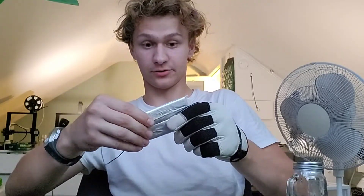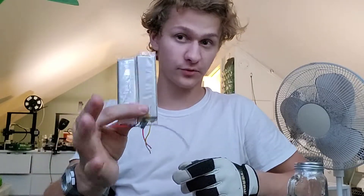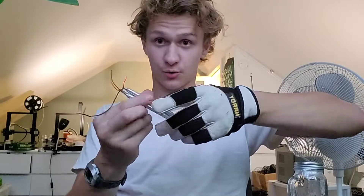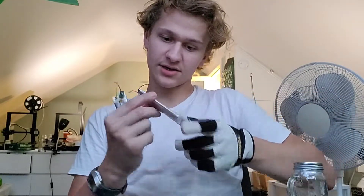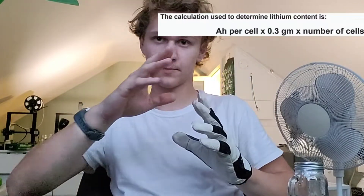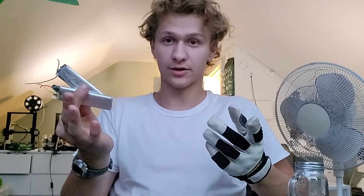This is a lot more lithium than a little disc. So this is 7.4 volts — it came in a pack of two — and this says it's 1450 milliamp hours. There's a little calculation: for every amp-hour multiplied by 0.3 grams per amp-hour equals the amount of lithium that you have.